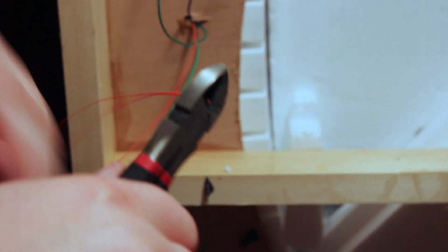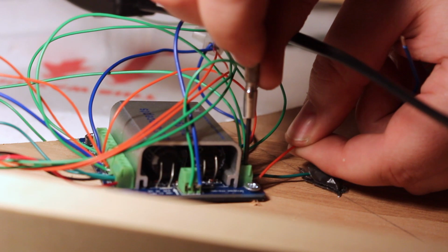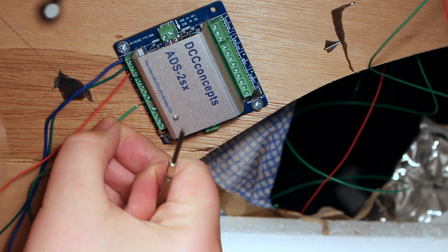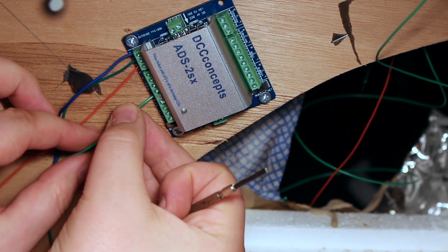And actually the wiring on this is going to be exceptionally simple. It's not quite 2 wires to the track, but it's getting about as close as it's possible to be to that. We've got the DCC Concept point controller screwed in on the underside of the board out of the way, and I've also started cutting wires to length, and we're going to start working on getting all of this put together, screw into these terminals, dead easy. We're going to solder some droppers to the track, also to the frogs for changing the frog polarity.